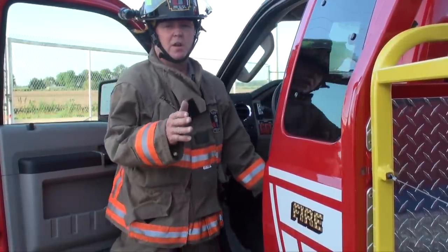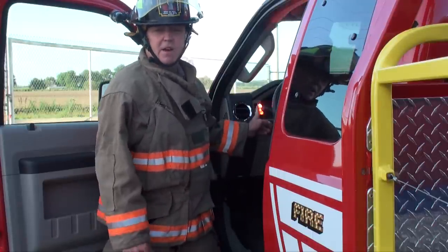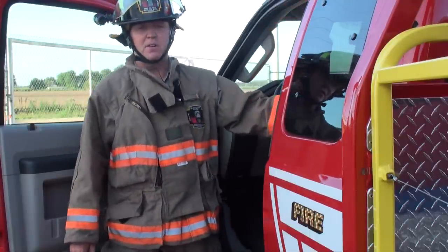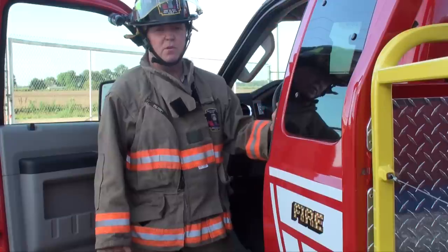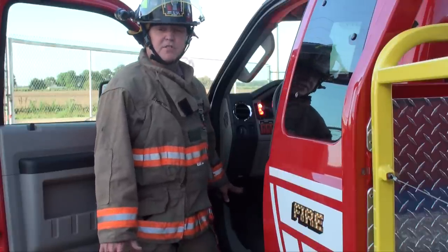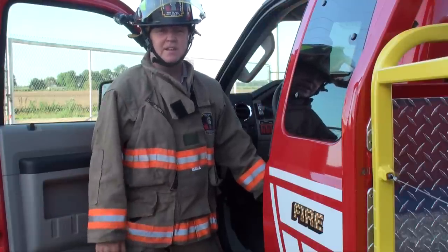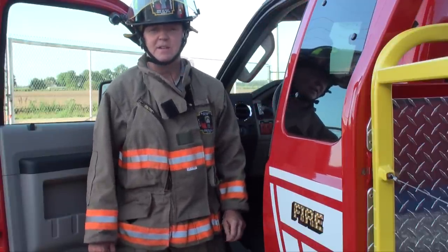With the door opening up, we need a warning system — both visual and audible. The light isn't just a red flashing light; it's an LED warning light, extremely bright, hitting the driver right in the eyes. Also notice the backup beeper — it's inside the cab. It's extremely loud in there to get your attention. If you stop and you don't want to hear that, just hit your emergency brake and it shuts off. It's a warning system letting me know I've got a door open. I've been going down the highway into bright sunlight and one of my doors jarred open — it gets your attention extremely fast.